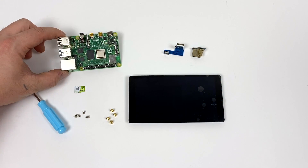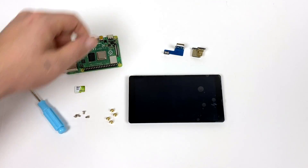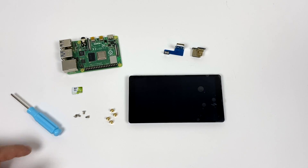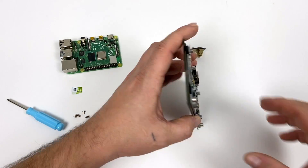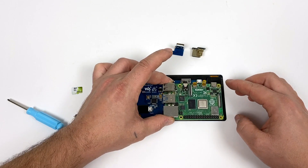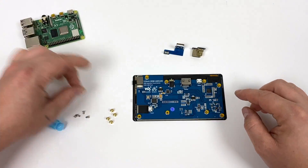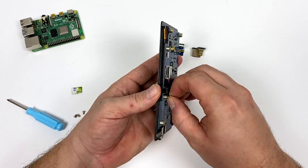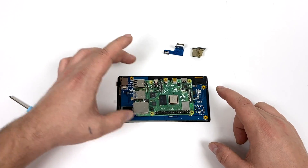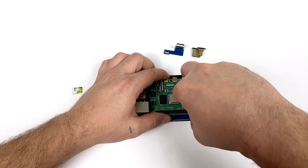Assembly seems straightforward. I'm going to be connecting this to a Raspberry Pi 4 so I'm going to use the Raspberry Pi 4 adapters. We also have some standoff screws and I flashed Raspbian to an SD card just so we could get up and running pretty quickly. All you're going to need to put this together is a small screwdriver. I want to line the Raspberry Pi 4 up — there are a few different standoff locations and it's going to be these four middle ones, so we'll just screw the standoffs in. Once those are in place I can put the Raspberry Pi 4 on top and there are four screws that will go right into those studs.